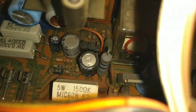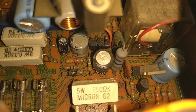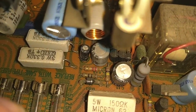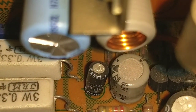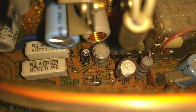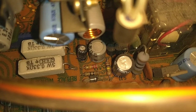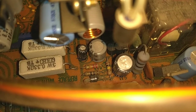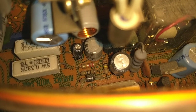There's a series of capacitors here. There's the 47 microfarad, which is a timing cap. And there's the gray guy, which is a 220 microfarad. And then there's the 1 microfarad at 50 volt, which would be considered your fast turnoff circuit — that just keeps it energized so that when you flick that power switch off, the relay immediately disengages before any destabilization of the amplifier can cause a transient in the sound. My bet is on either the 220 microfarad or the 47 microfarad — the 220 being a filter, the 47 being the timing cap for how long it takes for the relay to energize.